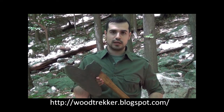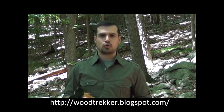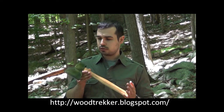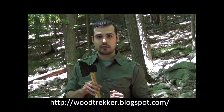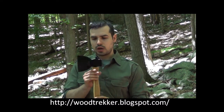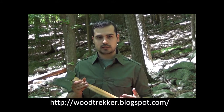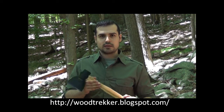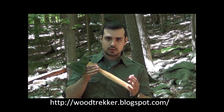These axes are hard to find new these days, understandably because very few people hew their own wood. The ones you will find are mostly used. What you're a lot more likely to find is the smaller cousin of the broad axe — the carpenter's hatchet or carpenter's axe. It shares some of the same features: the side of the head which faces the wood is entirely flat and the bevel is created on the side opposite the wood. Unlike the broad axe, however, the handle is not offset at all. It is used in the same manner as the broad axe to hew wood and create smooth surfaces. These are still in production by a number of companies — this one in particular is made by Vaughn and Bushnell. The broad axe and the hatchet are very specialized tools. They do a great job at what they are designed to do, but they're not a general use axe. They can be part of a collection, but if I could have only one axe, this would not be it.